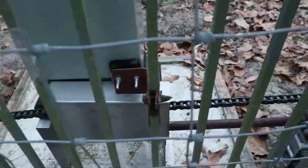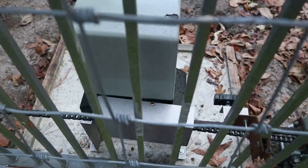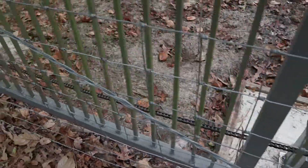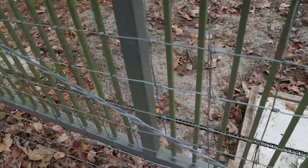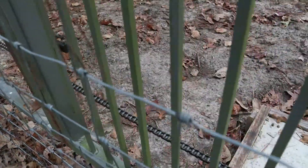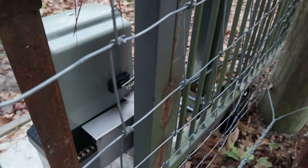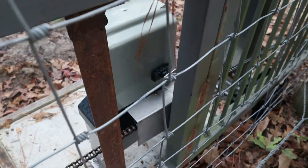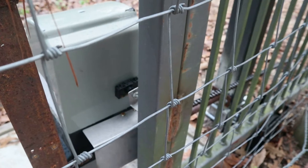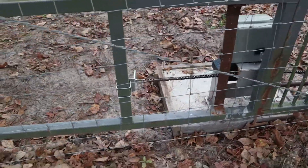Here's a shot of the sensor from this side — see how close it is to it. Now we'll close it. Maybe I can get you a better shot of the sensor from this side. One of the magnets is going to be set high side, one of them is going to be set low side — one of them is for opening and one for closing. There's also a switch up at the top of the box that you can flip left to right to reverse the direction of the way the switches operate.